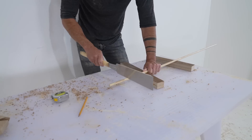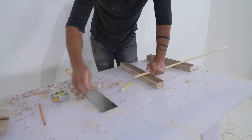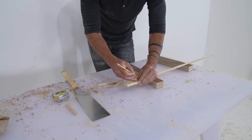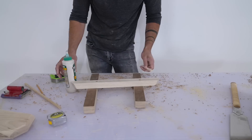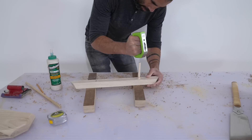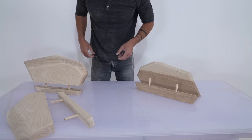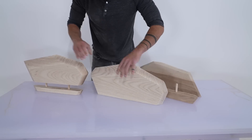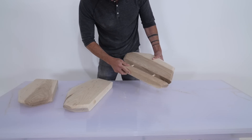I cut some four-inch long sections of half-inch diameter dowel. The holes and the dowels are both half an inch, so they won't slide in too easily, so I sanded down the ends going into the wider part of the shelf. I glued the dowels into the narrower piece that goes against the wall and pounded them in with my hammer fist. I sanded down the pegs going into the wider part quite a bit — I wasn't too worried about a tight fit since I didn't drill the holes perfectly straight and there'll be some pressure between the two pegs.